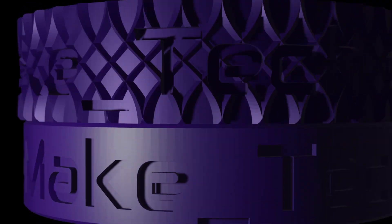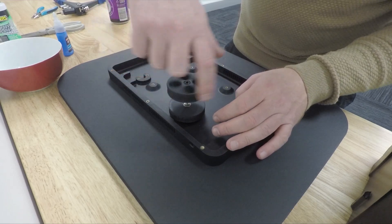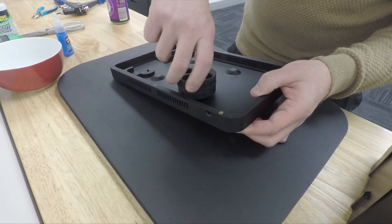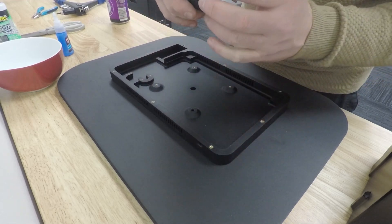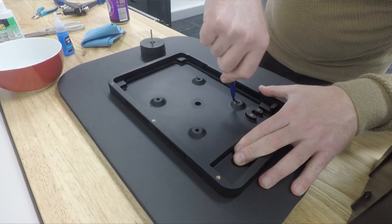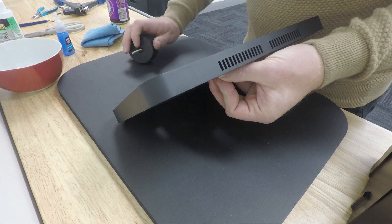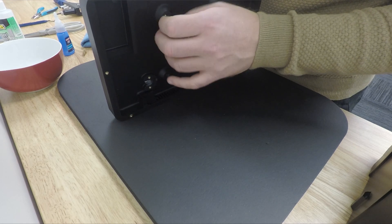Tools and method. I'll start with the tool I designed — it's got some pretty fancy CAD and I'll share the link for anyone interested. It has dual functionality: it can pull a nutsert in from the other side by screwing through from the opposite side. The downside is it has a very short life expectancy — even with a high tensile M4 screw the thread wears out quickly, and you can end up with the tool stuck in the nutsert. However, it does work nicely for pulling out a brass thread insert, so if you want to upgrade from brass inserts to nutserts, you can pull them out with that tool.